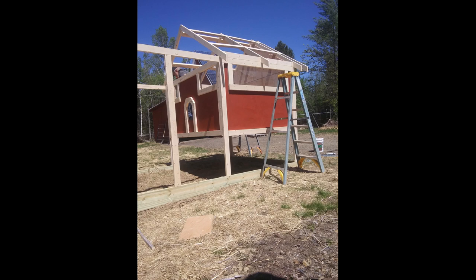If you're not very familiar with carpentry, one of the things you'll want is a speed square — a little 6-inch triangle with a 45-degree angle that makes cutting 45s really easy. Instead of cutting notches in the 2x4 to set on the top plate like house construction, we simply set it right on the plate and put a 2x4 between rafters: toenail the block in, slide the rafter up against it, screw it in. We put blocking between the rafters rather than on top for the metal roofing screws. You could also plywood the roof and shingle it if preferred.